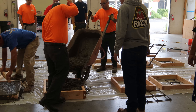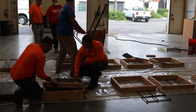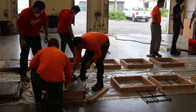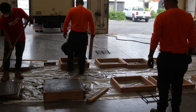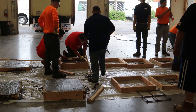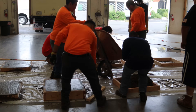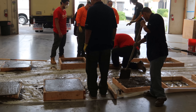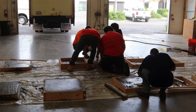They tied up some rebar. Ideally you'd want those up on Dobies and poured in place, but we like to just lift them up and drop them in as we pour. The concrete mix we use is just some bag mix — 90-pounders. Because we're pouring indoors on a cold concrete floor, which takes a long time to dry, I added calcium chloride, which is an accelerant. For every 3 ninety-pound bags, I added a cup and a half of calcium chloride — also known as CC.